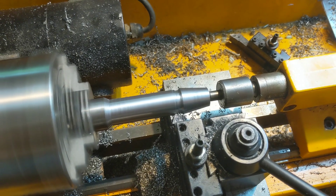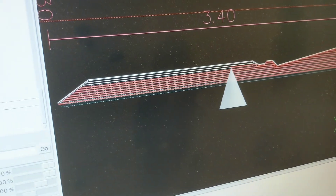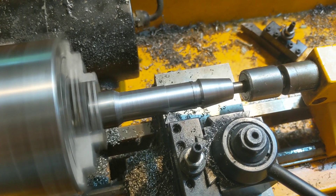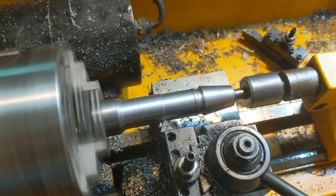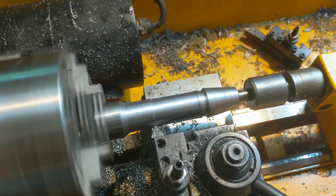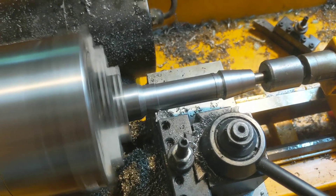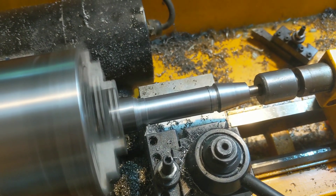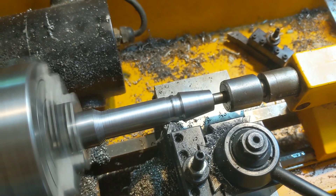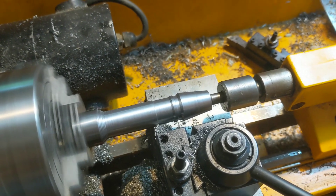Look at that — that's pretty cool. Starting to look like it. Let it go through these few cycles and just see. Then I make two finishing cuts that are five thousandths — don't ask me why, I was just goofing around with it — at a thousandth per rev. If it does it right... I think it does one more and then it should do two finishing passes.